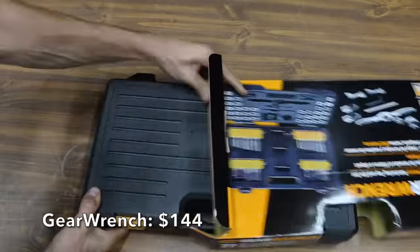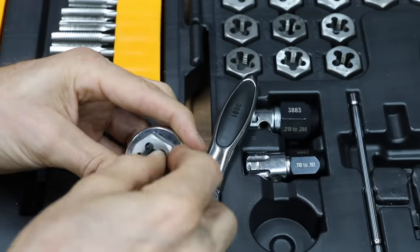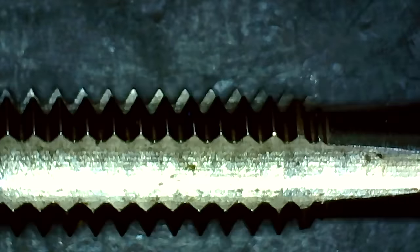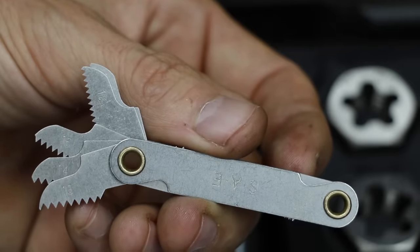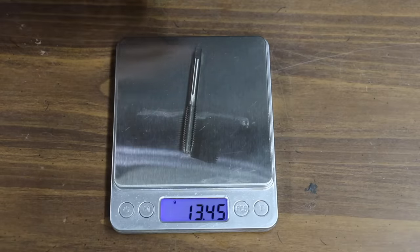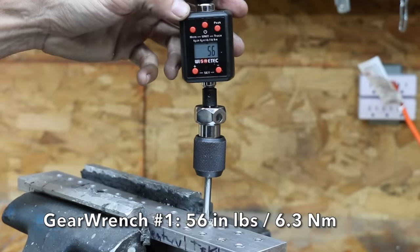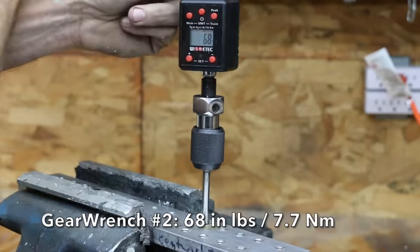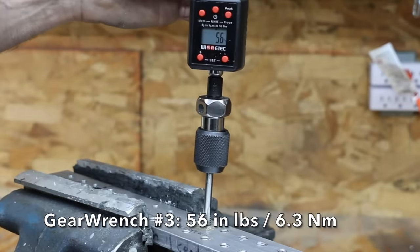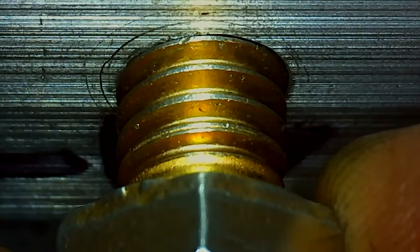At a price of $144 is this 77-piece Gear Wrench brand. The ratcheting T-handles wind dies with a 5-degree arc and have a reversing lever to eliminate hand-over-hand turning. The twist-lock guide system reduces walk-back and keeps the die centered. Die adapters work with a 3/8-inch drive pass-through ratchet and socket system. The set is packaged in Taiwan with goods from Taiwan and China. The Gear Wrench tap is the lightest yet at 13.45 grams; the die is about average at 26.43 grams. The Gear Wrench needed 56 inch-pounds on the first hole, 68 on the second, and 56 on the third, averaging 60 inch-pounds—second place behind the Sentry. It also has very little side-to-side play compared to most other brands.